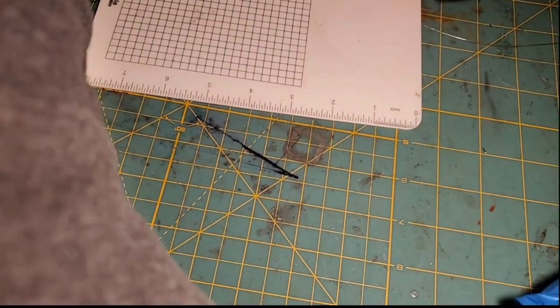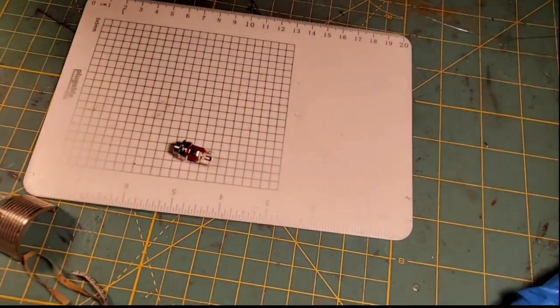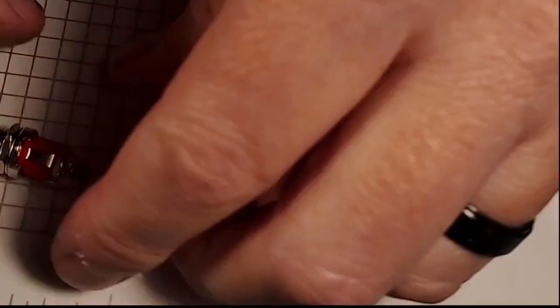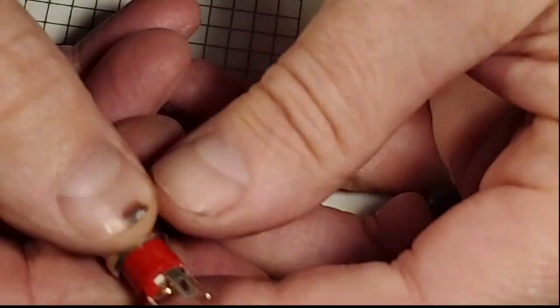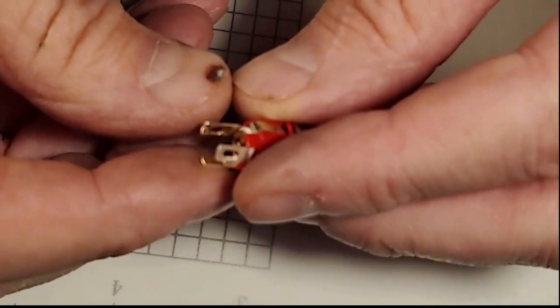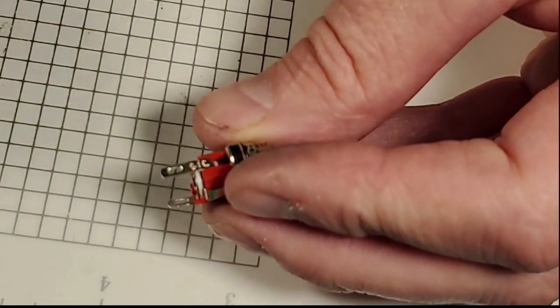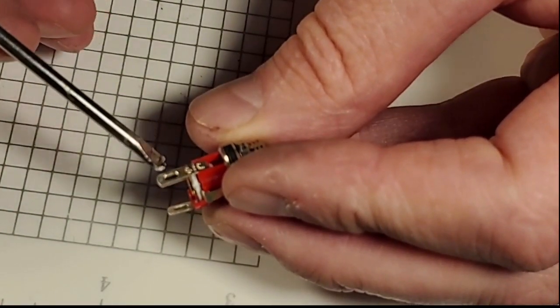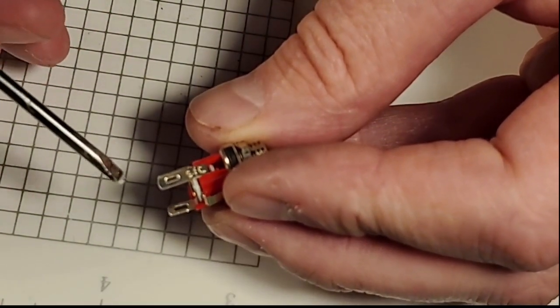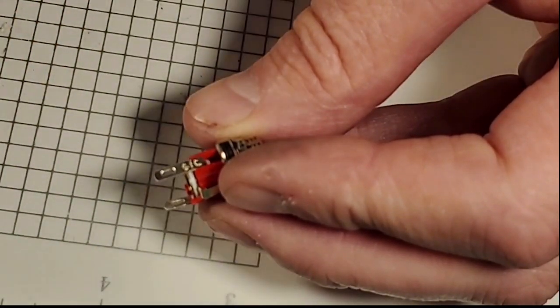A recharge port, we're going to be using a Switchcraft recharge port. Zoom in really quick so I can explain this. These recharge ports have 3 legs on them, and one of the legs is etched SC, which is going to be this one right here. If you can see the etching SC on there, this is the cutoff leg. This is the negative wire that's going to go to our Proffie board.